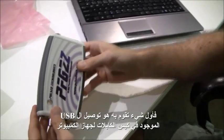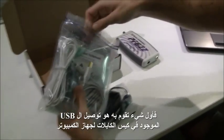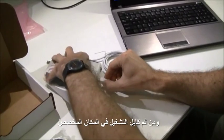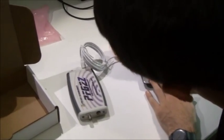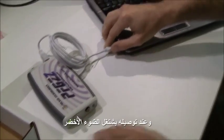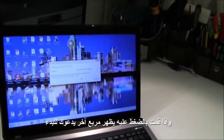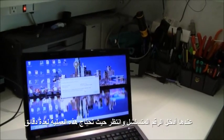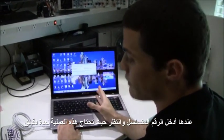First thing you're going to do with your PFG is you're going to connect the USB cord that is in the ziplock bag of cables. You're going to connect the USB cord to your computer to install the drivers and to set the port. When you plug it in, initially the green light is going to turn on and down in the bottom right, a window is going to pop up saying installing device driver software. Clicking on that brings up this window, and here Windows is installing the driver software. Immediately after, the serial port will be set. If this is your first time doing that, it can take a little bit longer, if not a couple minutes.